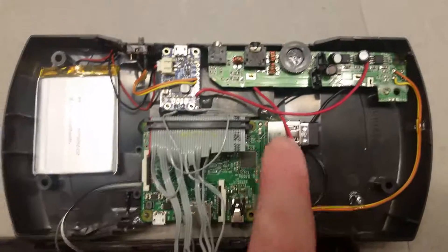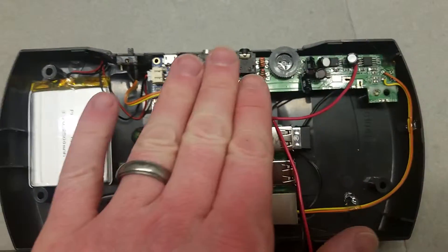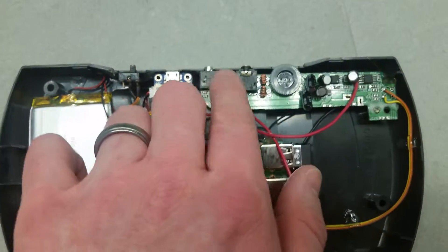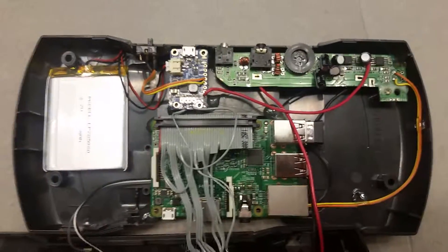What I really want to do is use a USB sound card and tie it into this. Or what I'm really thinking about is scrapping this board, building my own circuit board with the same spacing, putting my own jacks, and using a modern amplifier that runs on lower voltage with less noise — like a class D digital amp.